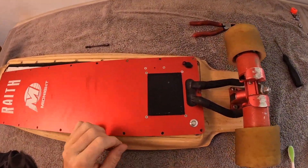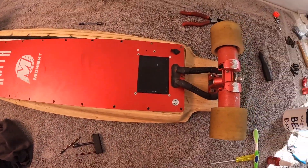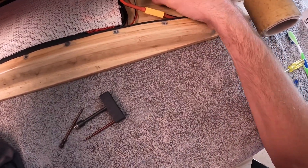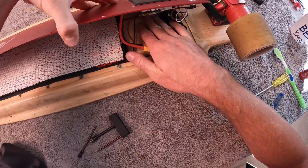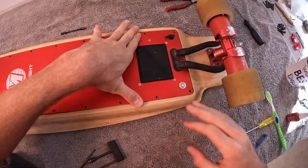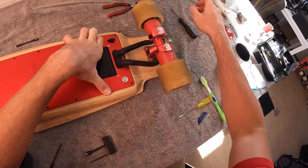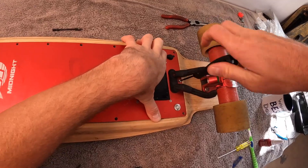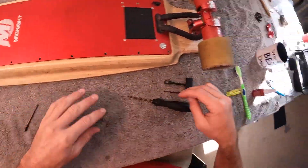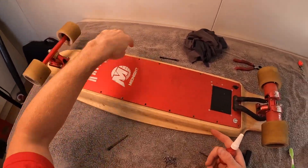When we do this we're going to use blue loctite on all the screws. If you get a bad screw just replace it — it's not worth having to extract the screw later, you're just better off putting in a new screw. You can see the seal is pushed in all the way around and the screw is seated. When fitting this lid, you have to push these wires into a position where they're not going to foul anything when you close the lid. Push down this connector and these wires and wiggle the lid into position. Get your mounting screws and just temporarily fit the middle one. Get all the screws in and thread them in, then tighten them up — do not tighten each screw individually.